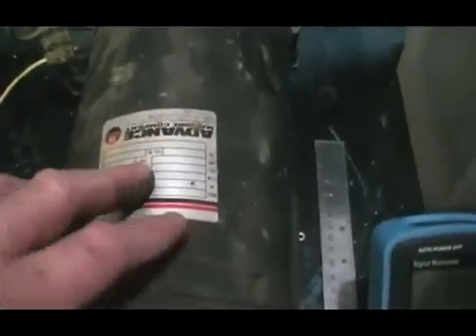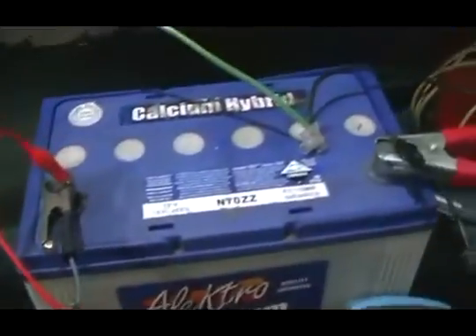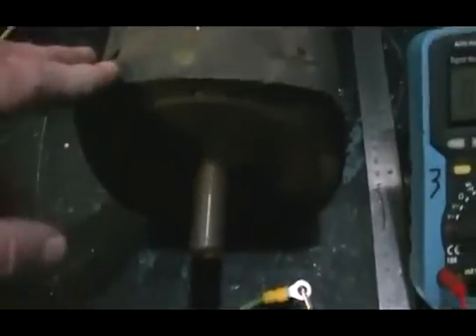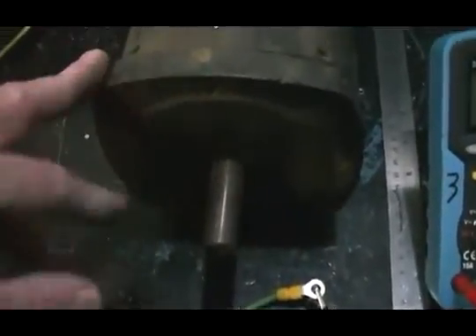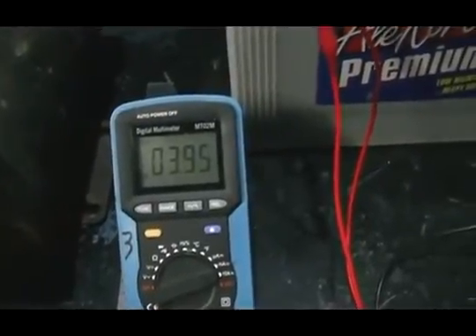The motor is running at the moment. It's a one horsepower 24 volt motor, and at the moment I have it hooked up to 12 volts. This is simply to get the amp draw and the voltage of the motor. We're going to strip it down, clean up all the bearings and free them up, put thin oil in, take a bit of tension off the brushes, and make the motor as efficient as we can. Maybe change the timing a little on the brushes and see how much we can get it down.